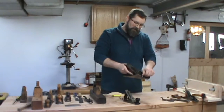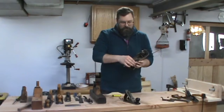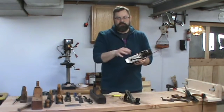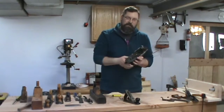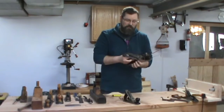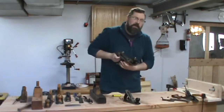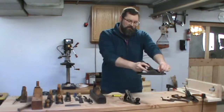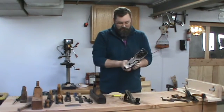The way I always try to do it is raise the iron as much as you need to, and then start lowering it, because there's play in the screws. You get hysteresis in the threads, and you always want to be lowering the iron so that you get a consistent turn. You might do it maybe an eighth of a turn at a time and then plane — you can make a pass, adjust on the backstroke, and keep going forward until you get the right thickness of cut.